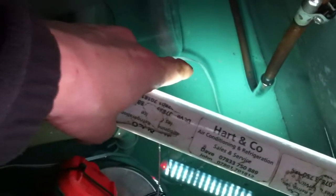The trouble with these is they need ice on all the pipes to set them up, because you can open the valve way too much if there's no ice on here. There'd be more load than it can deal with, and then once it's built a bit of ice up, it'll be frosting back with the compressor.